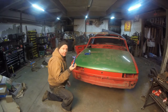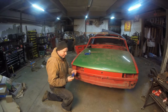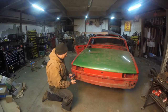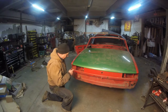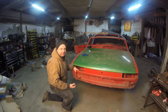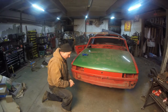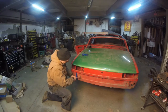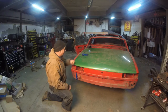What I'm going to use is basically the mount for the engine on the engine stands. Plenty of metal, it won't pull through. I was going to use a second one if there was no panel in between and just plate it. On this, there is a floor panel right here and it goes in between, so I'm just going to use some big washers. Let me pull it apart and put this on like that. Mark the hole, cut it, grind it, and weld up some plates. And stick it on, see what happens.